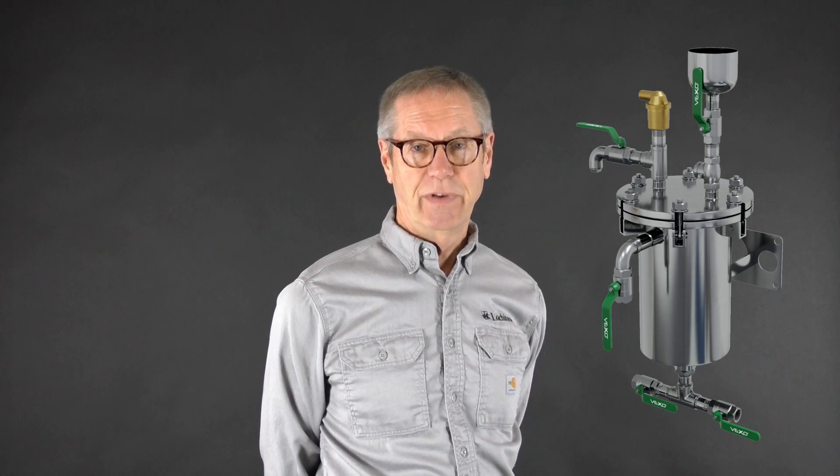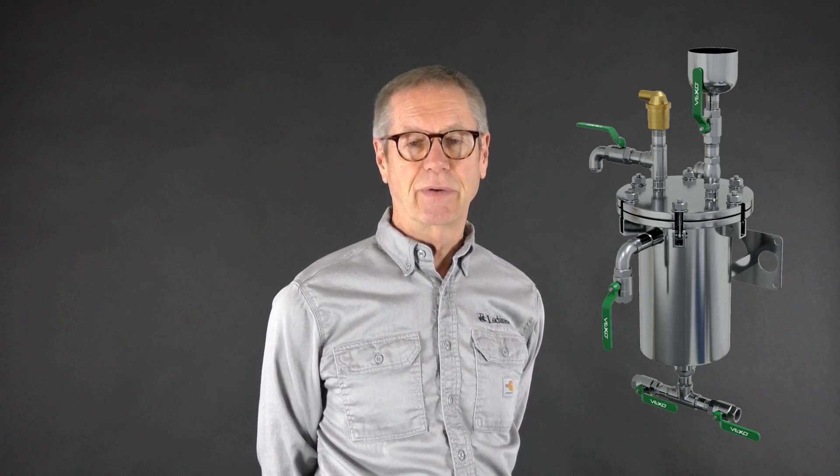With the side stream filter comes a cleaner that you put into the system and an inhibitor that you put in the system after it's done. All these things help protect the system from further complications from poor water quality. Components to protect your system include Y strainers, which we've started to encourage everybody to use on every high efficiency boiler, and a magnetic strainer like we just showed in the kit. Some components that might already be in the system include a water softener or a chemical feeder like a shot feeder — more common on commercial jobs than residential.